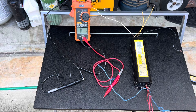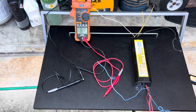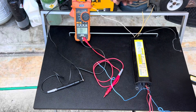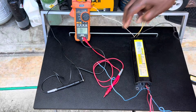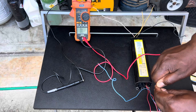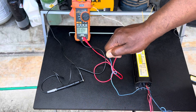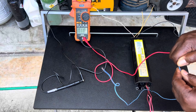That's how you check to see if this ballast is bad. Let's go over it one more time. Turn your meter to ohms, connect the alligator clip to the black (hot) and to your common neutral. Once you connect it, you want to make sure all of these wires are open — that means there's no short. You can see how I'm checking all of them. The blue has a short, which means it's no good. Sometimes it'll work, sometimes it won't when you turn your lights on and off.